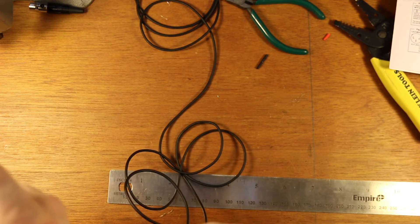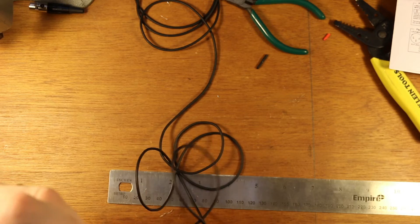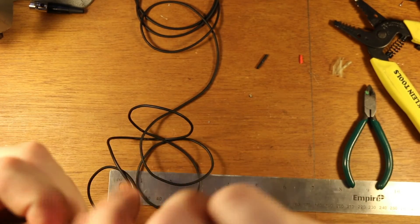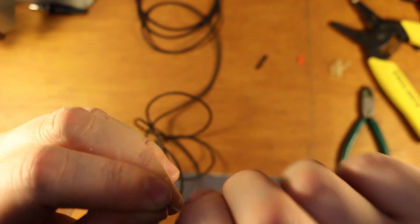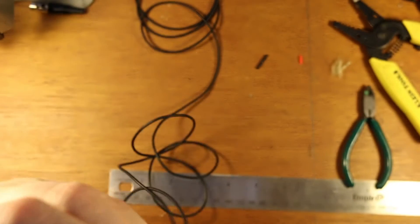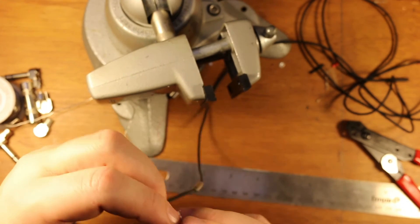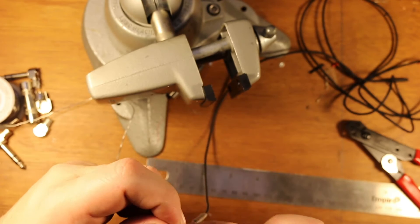And if you do this yourself, disclaimer: I'm not responsible for how it comes out. I really want to get all this silver, furry, hairy wire — this is our shield — and just bind it, kind of roll it in your fingers. Then we're going to tin this with some solder. The shield's been tinned, and it's becoming clear why maybe no one's made a video about terminating one of these — because they're a nightmare.